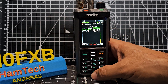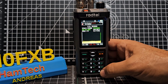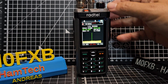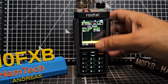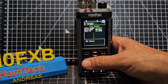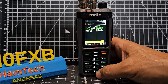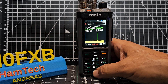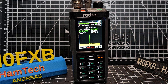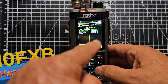We want AM because we're on airband frequencies. With squelch highlighted, let's try zero four zero — still not enough. Zero eight zero — still not enough. Hold down for monitor mode so we can hear. Now we're in AM. The squelch is set a bit high, so press star next to squelch and try zero seven zero, then zero six zero. Now we just need someone to actually talk. I've got my HF antenna in there — this is what we call spectrum scan mode.